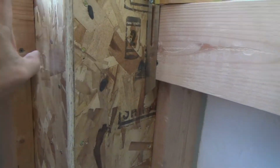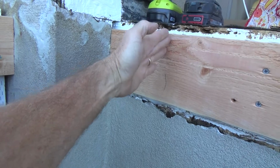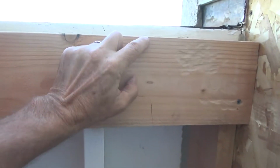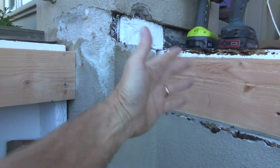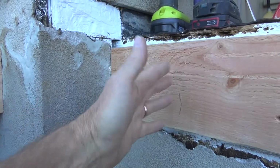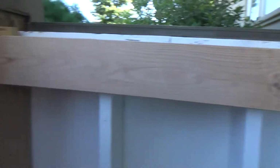And before I put these pieces on, I'm going to cut. I've measured a long one 16 inches over to about here, and I measured from the long point to the short point, and I'm going to cut it kind of snug, and I'm hoping it's going to fit snug right there, and I'm going to use that one for right there, 16-inch centers. But I don't have the exact mark yet. I've just got the approximate, and then I'm going to tap that over to here and over to here. That way it'll get me my exact line for those little blocks.